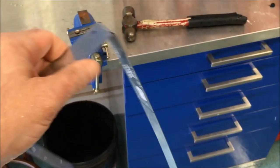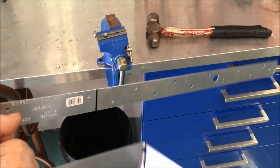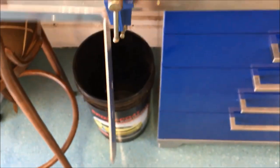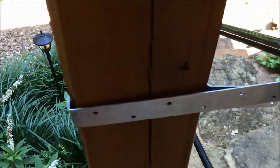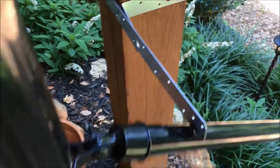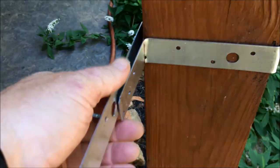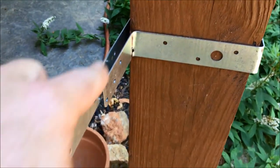To show you how I'm bending this strap — I've measured one side at a time on the column, then I mark the bend point, and I use the vise and the hammer to make these nice clean edges. The strap came out perfectly. I don't have to drill into the deck structure. What I'm looking for is resistance to lateral load, not up-and-down movement — so I'm trying to stop this side-to-side motion. I'll trim it to size with my sawzall, then bolt it here and to a clamp that goes on the post.